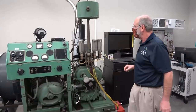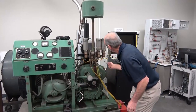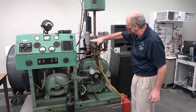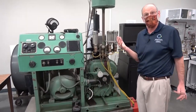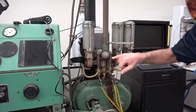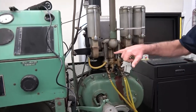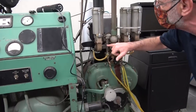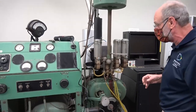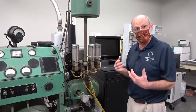We have three different fuel tanks. Each fuel tank has a knob directly below it, and as we rotate that knob we actually raise or lower the fuel tank, which will raise or lower the fuel-to-air ratio. You can actually see the fuel meniscus in here, although right now the tank is not full of fuel. You'll be able to see at least a relative measure of the fuel-to-air ratio.